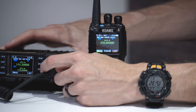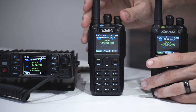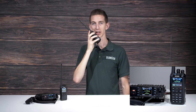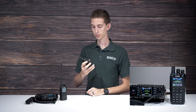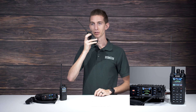So we are all set up on the two handhelds. Make sure we have our repeater system switched on — press that, and now it is on. So here's the really cool part. I'm going to transmit on my radio and we'll see if it works. Testing 1, 2, 3 — this is W3AMG trying out my newly created repeater system. Awesome! We can hear it coming through the speaker on the other radio. To verify it's really working, if I turn this repeater off, this radio on the table should no longer receive anything. Testing 1, 2, 3 — this is W3AMG. Nope, not working, because we're using the separate receive and transmit frequencies. Turn it back on — testing 1, 2, 3 — this is W3AMG. Awesome, how cool is that?